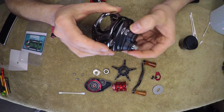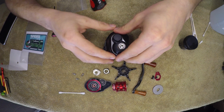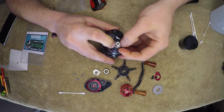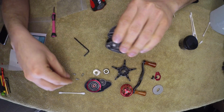Yeah, I should make sure. So your spool, basically what's connected to your spool tension knob applies tension to these free-floating spools like this. There's a plastic rod, and that goes inside your pinion gear, so make sure that's in there too. Alright, so okay, that's set. So I'm going to hold this, I'm going to put these screws back in.